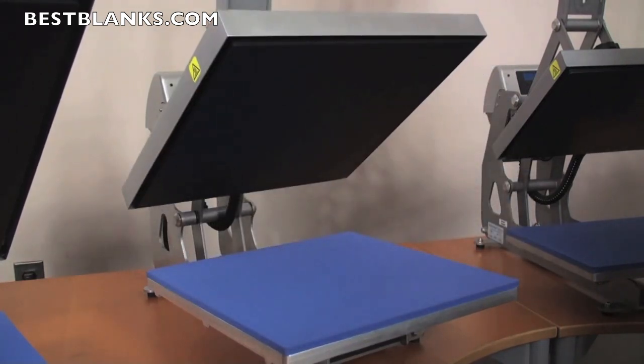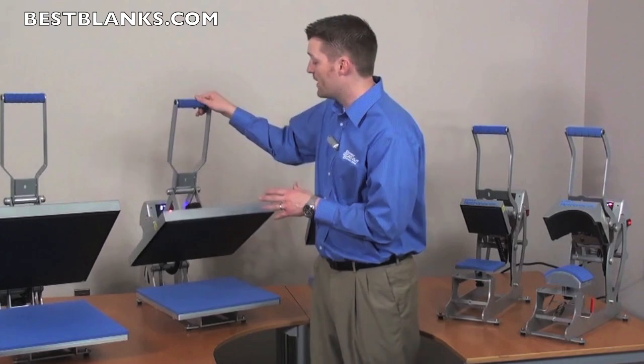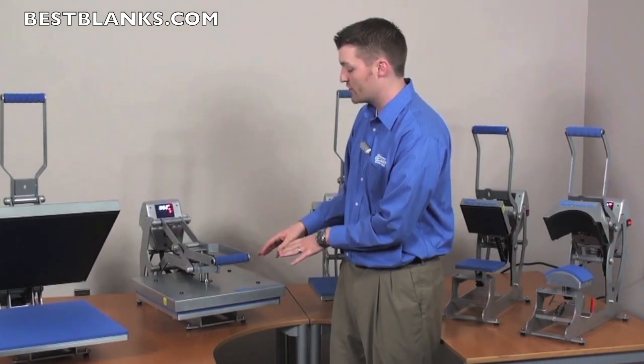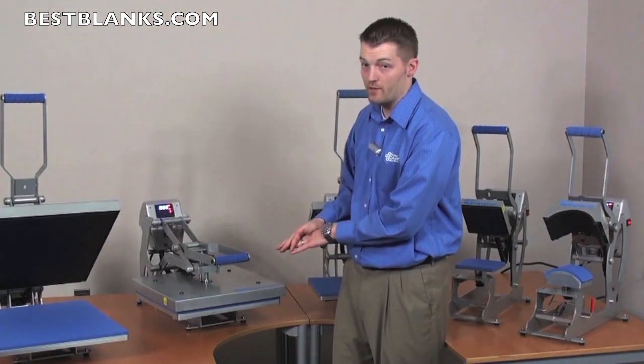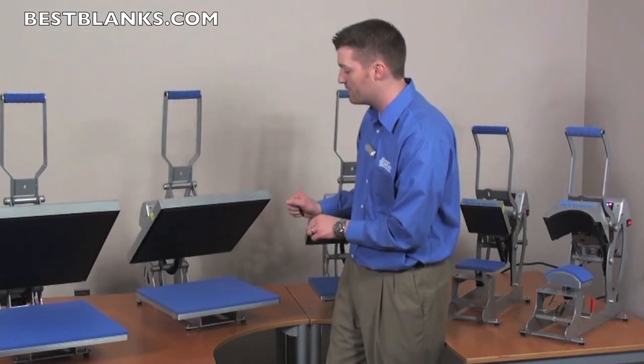This really makes for efficient production. Now we need to talk a little bit about pressure. You may have noticed when I lock the press down, it reads out a pressure of one — that's how much pressure it's actually delivering on your item, or in this case, since I don't have anything loaded, it's delivering that on the bottom platen.